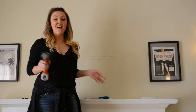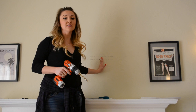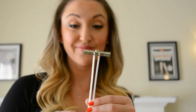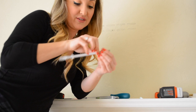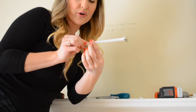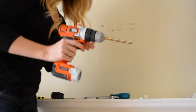Next, you're going to need a half-inch drill bit — this is for the toggle bolts. If you have plastered walls and you find that you've landed on something that is not a piece of wood or a stud to drill into, you're going to need to use a toggle bolt. What a toggle bolt does is create a kind of anchor. You scoot it in after you've drilled your hole, it opens up, and you use these ends to wiggle it to make sure it opens. Once it's in, you zip it and that creates your anchor.